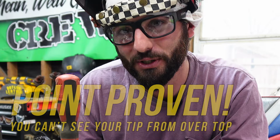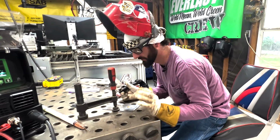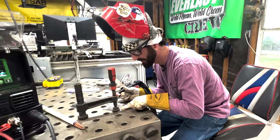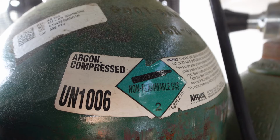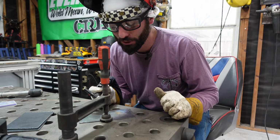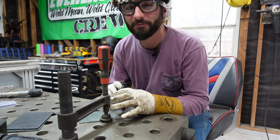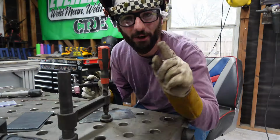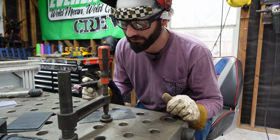That's a little happy oopsie poopsie, and I can't see a thing right now. Unlucky for us, I just splashed myself, but lucky for us, it gave me a little indication of, hey, you silly bean, you forgot to go turn your gas on. All that schmutz and all that sound, that's no good for a weld. But now, we've got our gas on, we've got a nice clean strike. I'll be careful not to arc myself off next time.